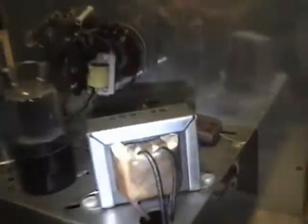As for the tubes, this was probably built not too long after World War II when they used surplus tubes that were available, like these acorn tubes. Their upper limit is about 200 megahertz, which explains why this caps out at channel 6 and doesn't cover 7 through 13. This other tube is actually a radar version of a 6J5 that's been converted to work as an AC rectifier — they solder the grid and the plate together. In fact, all three tubes are actually soldered in place.